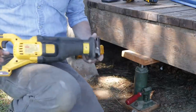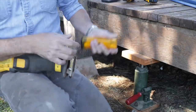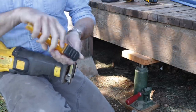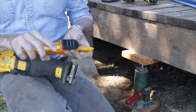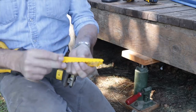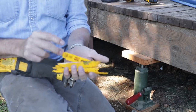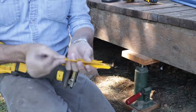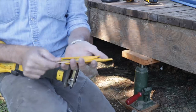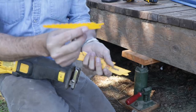One of the handiest tools I can have is a reciprocating saw — I'd say after a skill saw, this would probably be your go-to. The blades basically break down into two categories: you've got your wood blades which have big coarse teeth, and then you have your bi-metal blades which have fine teeth for cutting aluminum and metal. Typically for wood demo stuff you're best off with a big aggressive blade.